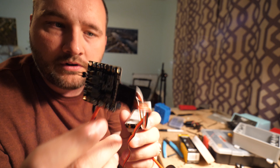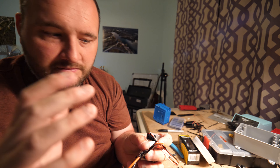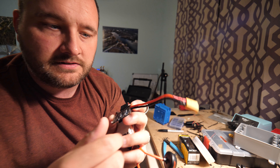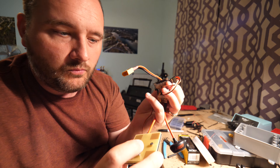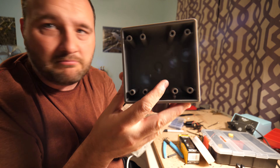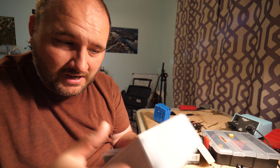If you haven't considered using a power distribution board inside of your ground station, I think it's a great idea — you can get all the voltages you need and you don't have to worry about overfeeding something. I've also got a couple of 5-volt pins from the PDB, and I'm thinking I might connect a USB header to that so I can charge something via USB from a lipo battery. Next I'm going to build this inside of a gray box and mount it to my microphone tripod.